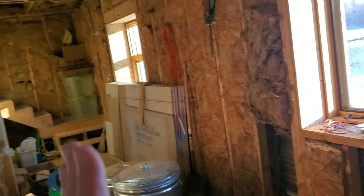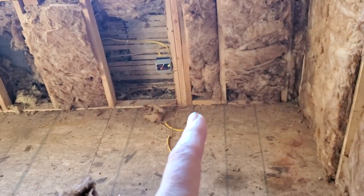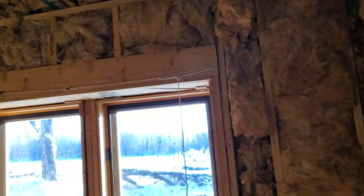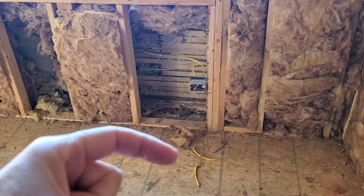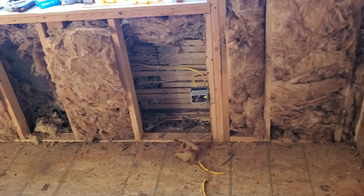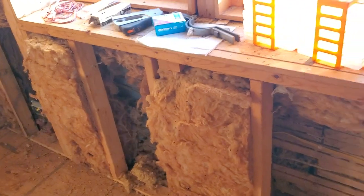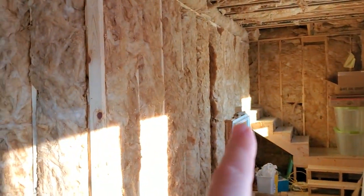This floor was all reframed because the joists — this span is 18 feet by 23 feet — were all rotted out on the ends where they bore into the original stone foundation. What I ended up doing was jacking up the exterior load-bearing walls and pouring a grade beam: about eight inches tall, 12 inches wide of concrete. That's why we have these extra-thick exterior walls over here. The new bearing wall is this two-by-four wall here — you can see the old lath behind it — and I'm going to insulate this to around R-40.